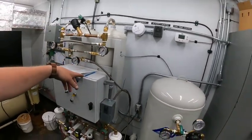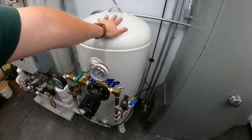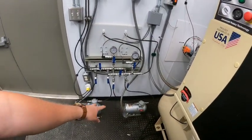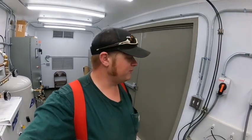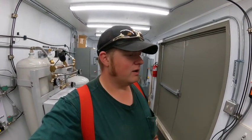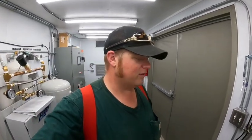From there, the pure oxygen, which is about 95% O2, gets pumped into the storage tank, and from the storage tank goes back out to the compressors. These two small gas compressors compress the O2, the purified oxygen, and inject it into my force mains. I have two force mains, an 8-inch and a 4-inch, and depending on which one is running for which part of the season, that determines which force main is running. Obviously, at build-out peak season, we're gonna be running the 8-inch, but right now we're running the 4-inch.